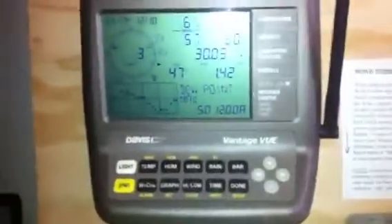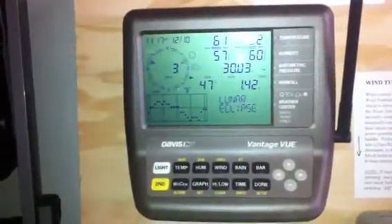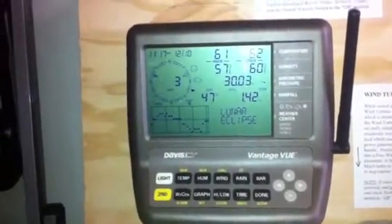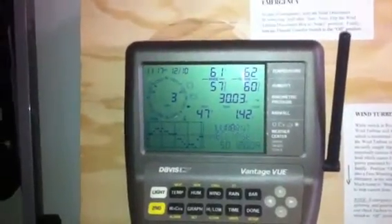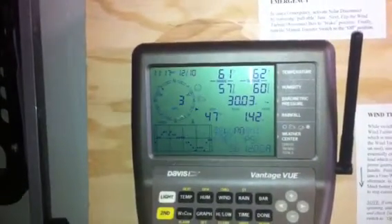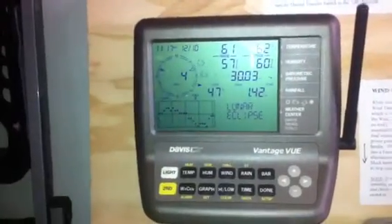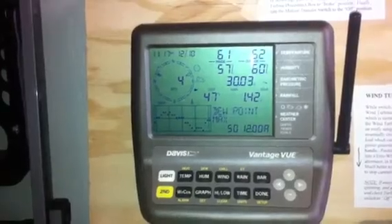Part 2 on the wind, breaking it down. I started out going into the importance of a really good weather station — if you're going to go wind. By good, I mean not only the ability to track all the data log points, but also to have quick transmission. So when it says 3 miles an hour right there, I know it's blowing 3 miles an hour within the last second and a half to 3 seconds. That's important so you can track your production.